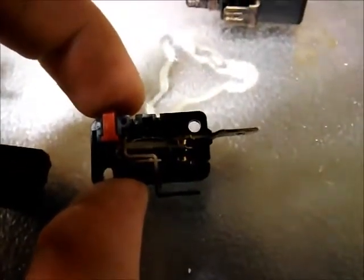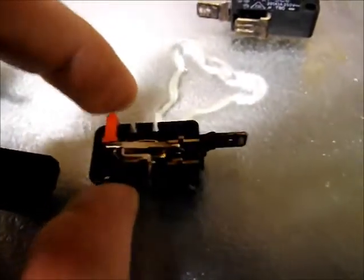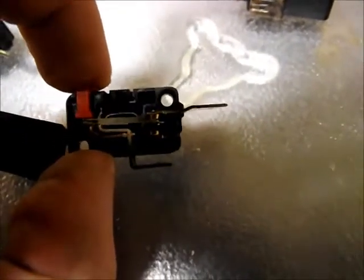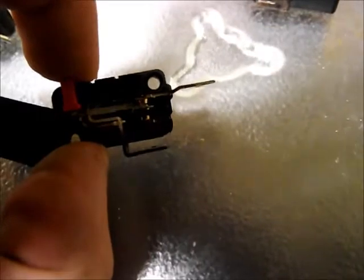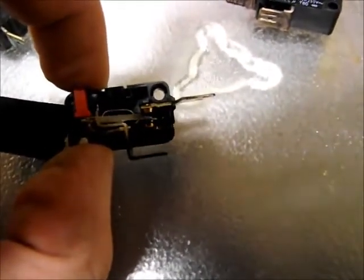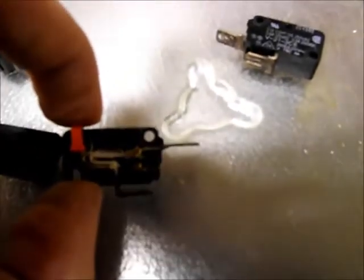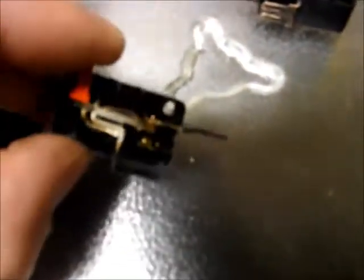So, how do they work? This is a normally closed microswitch — the contacts are closed until you hit the button. Very simple. They have a spring up the top, which is that loop. They're basically very digital — they don't really have a half-contact arcing position the way a light switch does, where you can often get it to arc if you really wanted to. This switch is very, very clean in its operation.